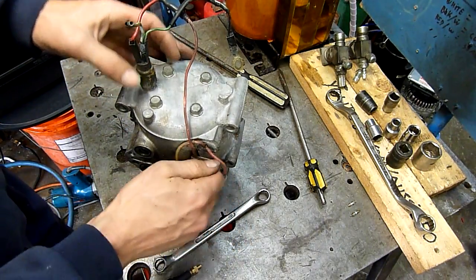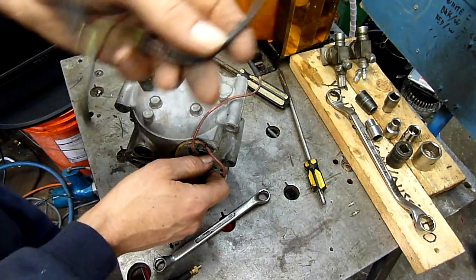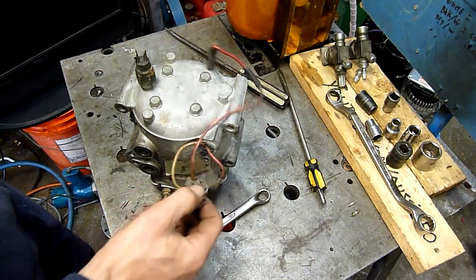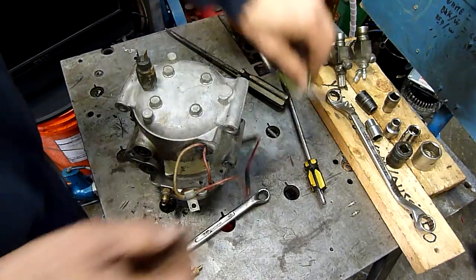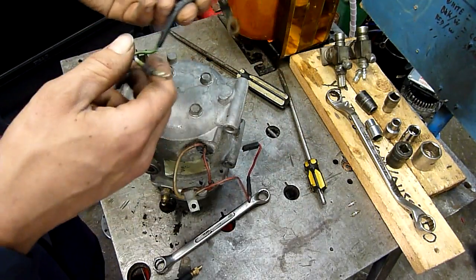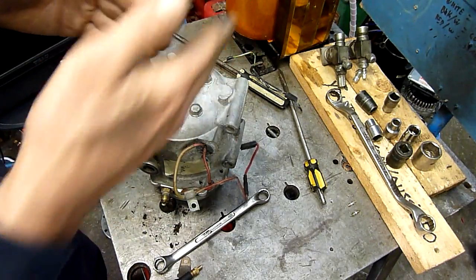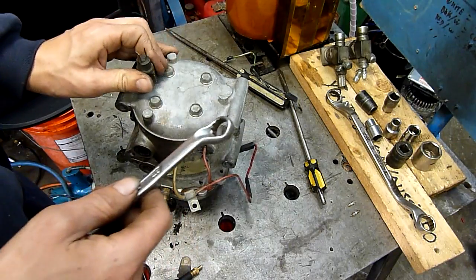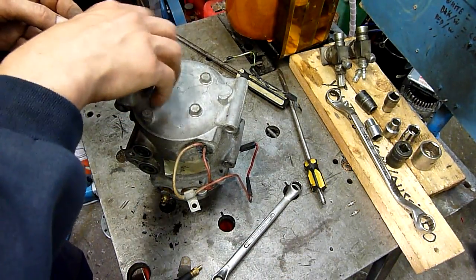I'm going to remove all these parts, which I've already loosened off previously. That connector has a little diode in it, and the diode simply goes to ground. Main DC doesn't go to ground, of course — only back EMF goes through the diode, because direct current will only flow one way. Whatever comes back through the system goes past the diode and straight to ground.